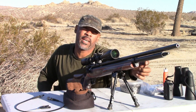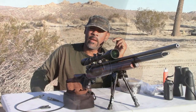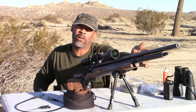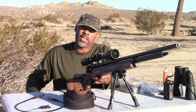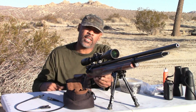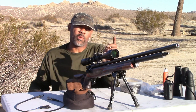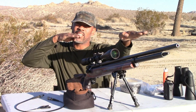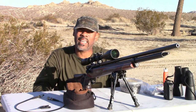One of the other key features — and I don't know if I'll show you a closeup later — is the front of the stock right here is bedded. What that means is I put a pillar bed in the stock and then took a barrel band, turned it upside down, and mounted that to the stock — I had it custom made. The rear of the gun where you normally would install the action is also pillar bedded. So the original mount is aluminum pillar bedded, and so is the front of the gun. This gun sits like this and when it kicks, it does not move. It can't go anywhere.